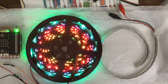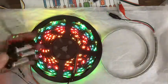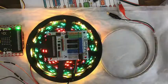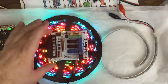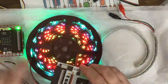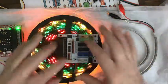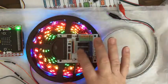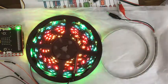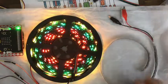I like extension boards that have extra power. The Bit Booster actually has 4.5 volts. The Maker Bit lets you plug in anything from 6 to 12 volts — it routes only 3 volts to the micro:bit, but the rest is accessible to other ports. Most ports on the Maker Bit are 5 volts, and it routes all available power to motors, allowing you to power servos and a bunch of NeoPixels all at once.